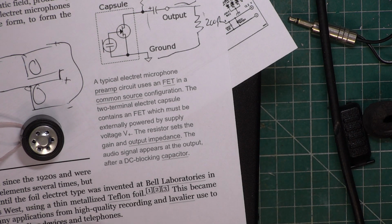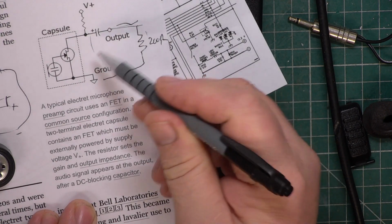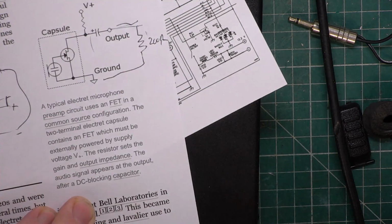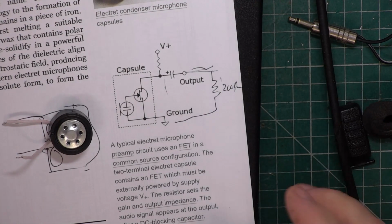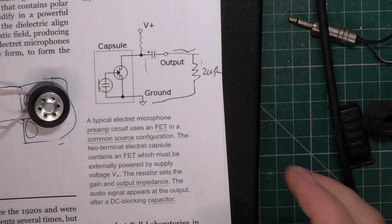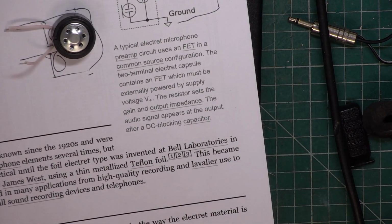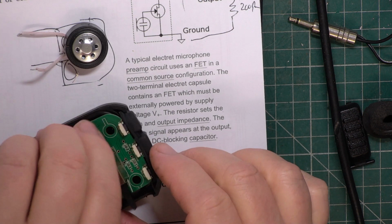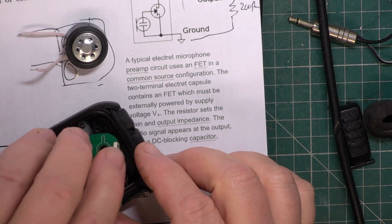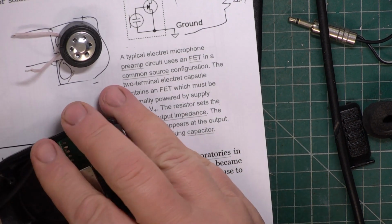I think what they've ended up doing is not only they've cancelled out most of the 1.5 volt preamp voltage, I think it's out of phase, and so they've actually generated a noise cancelling microphone which you have to talk very loudly into. So that was absolutely bizarre. Yes, this radio will work on a dynamic microphone, and you can wire it up to the connector in the way which would be normal for the radio. But you can't add it into the existing microphone circuit when there's already a preamplified microphone in there.